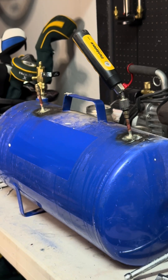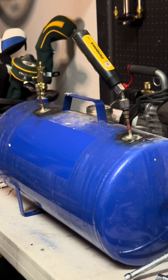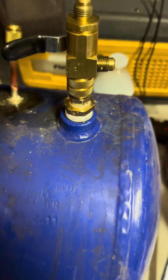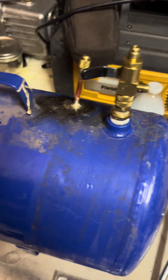We've been holding 94.8 PSI for 15 minutes. We're going to use this for evacuation demonstration. I'm going to be posting a video on why your SMan micron gauge is not accurate and you should not rely on that for microns. From here on out, it's nylog or nothing. Those threads were leaking, so I nylogged on under the Teflon tape and on top of the Teflon tape — she ain't leaking anymore. We're solid.